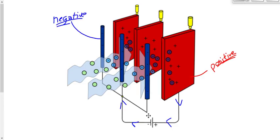Now, over here on the left-hand side, you can see this air being blown through this precipitator. And inside that air, you know that there are dust particles and pollutants of different types. And generally, those dust particles and pollutants are neutral. They're not charged. But when those pollutants and dust particles get blown through those negatively charged rods, when neutral particles touch negatively charged rods, what happens?